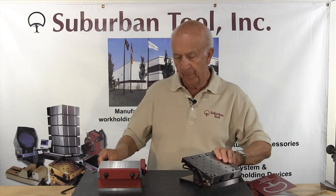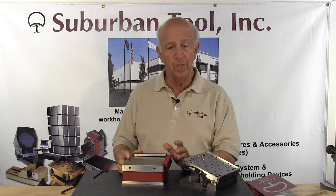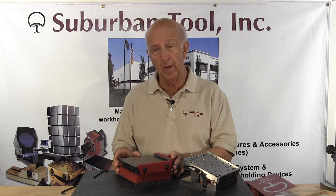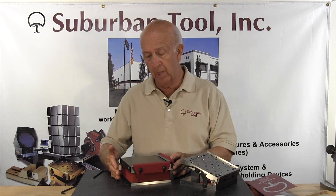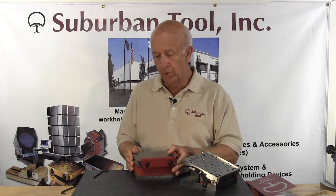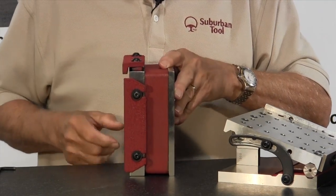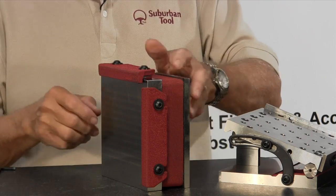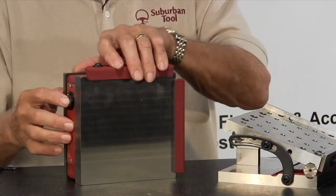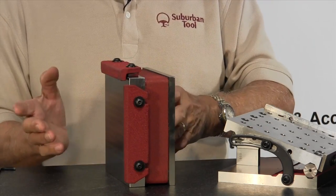Another feature is that we also offer a magnetic chuck. The magnetic chuck itself can be used independently of the sine plate. For example, if you wanted to grind something on a surface grinder and it had something that overhung on one end, you could set it on there and let it hang over. You can also use this as what we call a squaring chuck — set it on its side. It's accurate within two tenths in any direction. You can remove the rail, set it on either side, put your part on there, engage the magnetic chuck, and you're ready to go for either inspection or grinding.